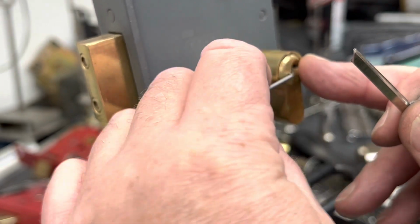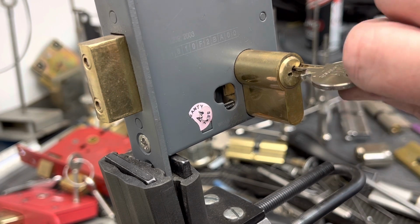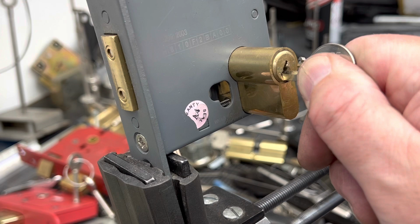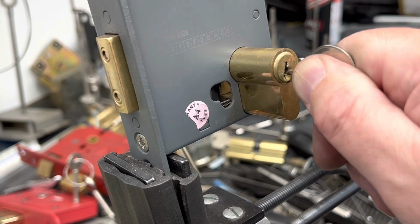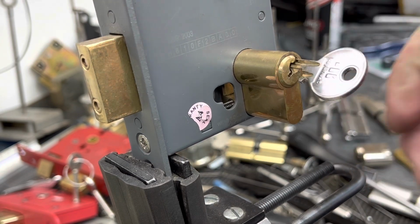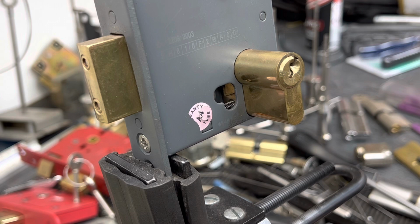we just remove that for a moment, wiggle it out. It's not doing any damage. We're going to drop that in there. We're going to push forward, and we've engaged. We've picked the cam up, and the keys are turning on the other side. Yeah, that's one way of doing it. But sometimes you ain't always got the right blank. They don't always fit everything. So what else do you do?